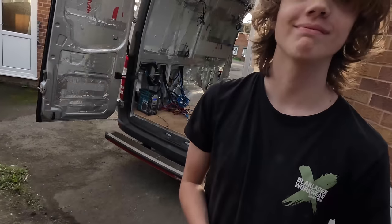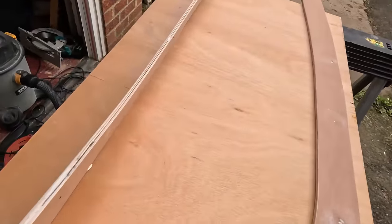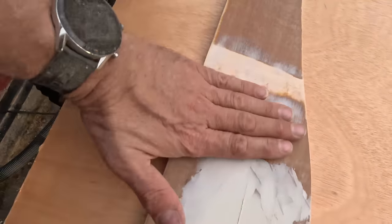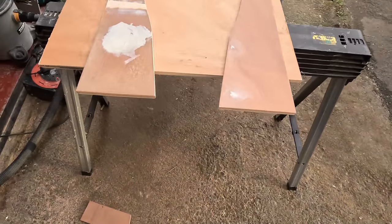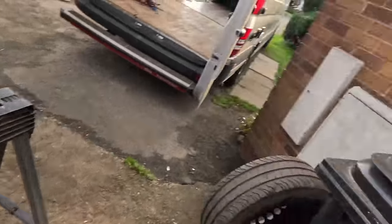The boy is here - he's been helping sand. We've done a lovely sanding job on the fronts of these, also some filler work in the little holes. There was a nasty bump in the plywood from using scrap ply, but we managed to grind and sand that out. A quick sand off on that bit and we'll get the primer undercoat on. Then we'll see what the temperature does - it's coming into evening. If it dries quick enough I might put the first coat of salmon on tonight. Tomorrow I can prop them up and have a look - going to be quite a lot of colour.